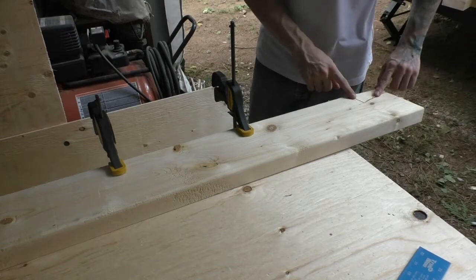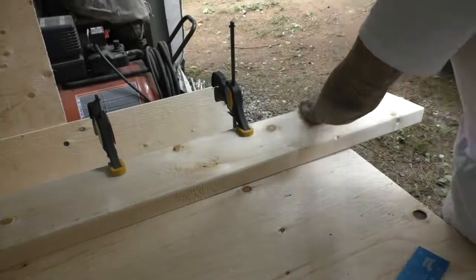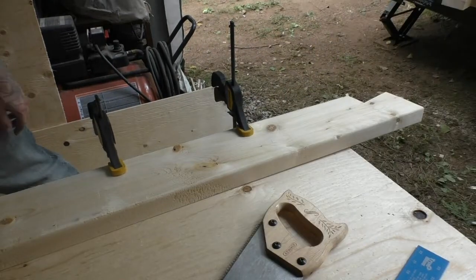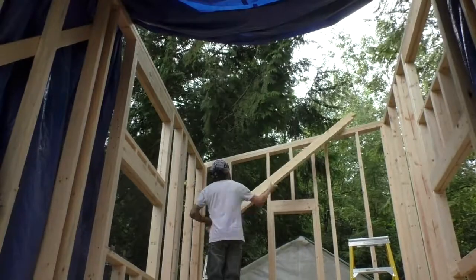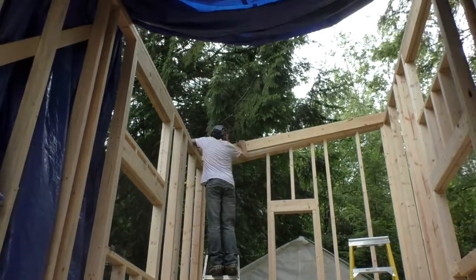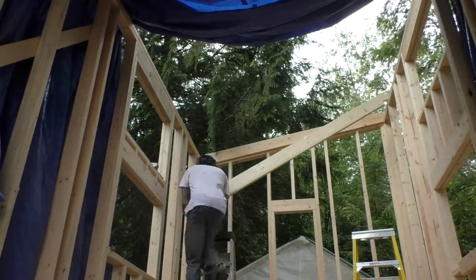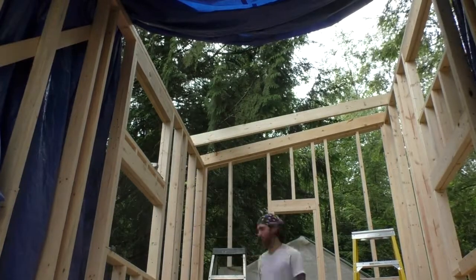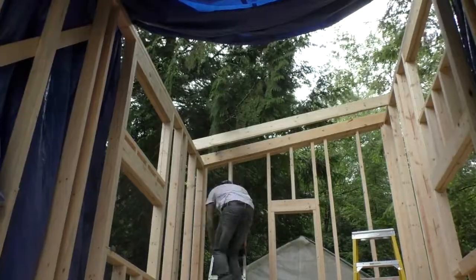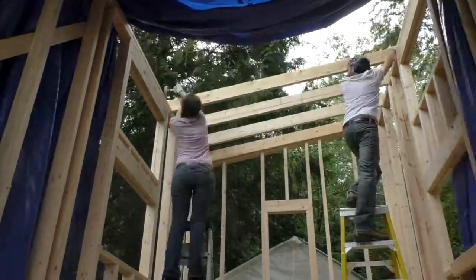Go to where the two points meet and use a handsaw. There we go. If there are any little imperfections, just take a chisel, then go and do the same thing at the other end. It's a good idea to test fit the first piece to make sure the method is going to work out. It's important to make sure that the corners of the bird's mouths are at the correct distance from each other, as this length sits in between the top plates. We confirmed this before making the first cut. The first test fit was a success, though a little tight. We decided to test fit a second piece, then carried on with cutting the rest.